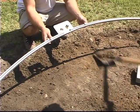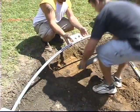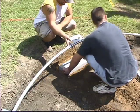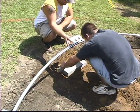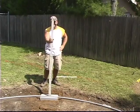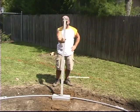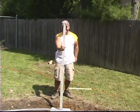Place a patio block under each of the bottom plates or cuffs. The block should be recessed into the ground so the track is still sitting on solid ground. Make sure the block is level in all directions. Once the block is in, recheck the level of the plate or cuff to make sure it's at the same height as it was before you put the block down.